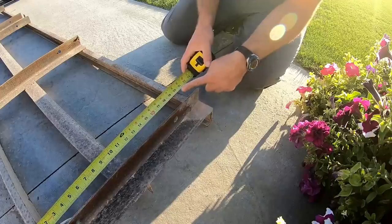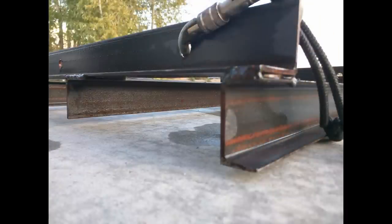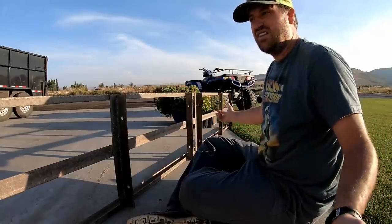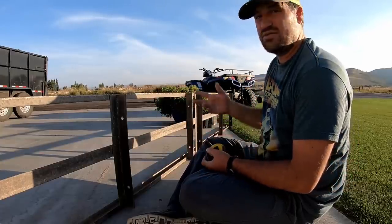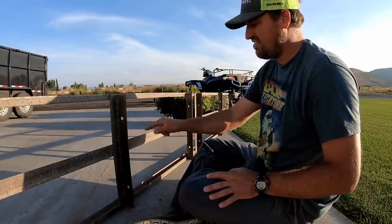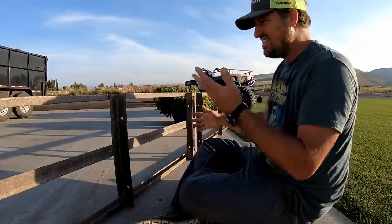It is exactly 20 inches across. This distance is one inch from here to here, and from here to here it's two inches. I've got a piece of two-inch angle iron right here in the middle, and then a piece of C-channel down here. I only bought two pieces of steel: a piece of C-channel that was 20 feet long, two inches by one inch, and a piece of angle iron that was 20 feet long, two by two. I cut the C-channel in half at 10 feet and the angle iron in half at 10 feet. From the remaining 10-foot C-channel section I got six pieces at 20 inches each, which I welded as cross members to keep it rigid.